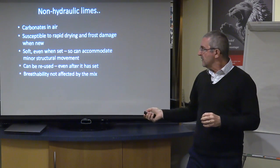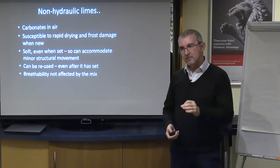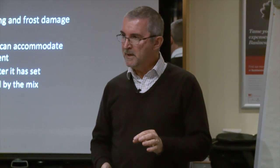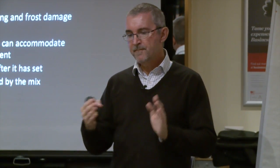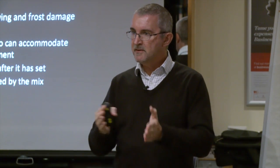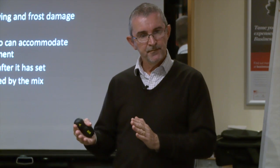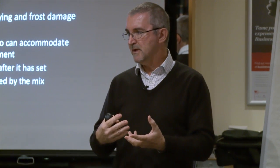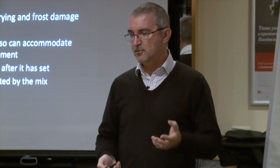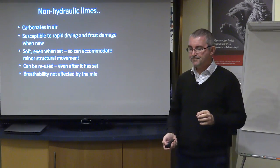So the other important factor is that the breathability, unlike the natural hydraulic limes, the NHLs, is not affected by the mix. So if you're using a very weak mix or a very strong mix, depending on how much sand you've put in it, it doesn't matter. You'll only have that judgment based on what you want to do with the mortar, but the breathability is not affected at all. So it is just the most amazing product.